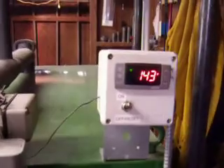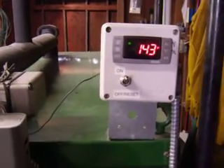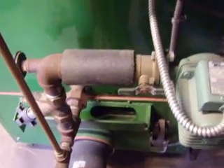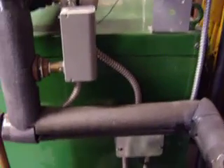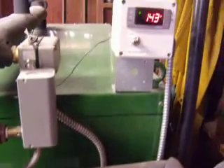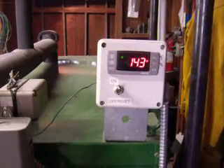It's an awesome unit — if it burned out tomorrow I would replace it immediately. It does work well in keeping the return temp at around 140 or not much lower. There's a lot of discussion on the forum that when you get below 140 degrees on return temperatures, that's what can cause creosote and moisture condensation issues, which over time becomes caustic to the inside of the boiler and the tubes and can destroy the whole unit. So for me it was worth it — the controller at the time was $275 or $300, and I think it was a good investment to protect the unit.